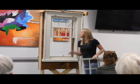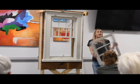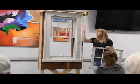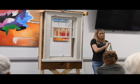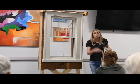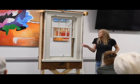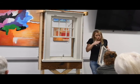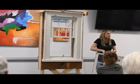So you want to make sure at least one side is unpainted. Usually we recommend leaving the bottom of the bottom sash and the top of the top sash unpainted. The sides you don't want to paint, obviously, because it's going to run into friction issues and not slide up and down. If you do have problems with that, you can wax it. You can put some wax and it will glide a little bit easier.